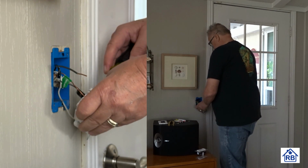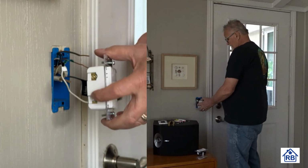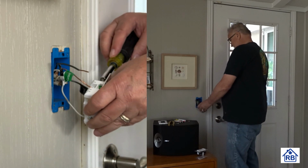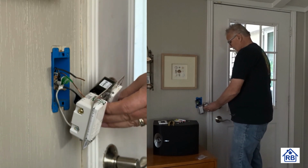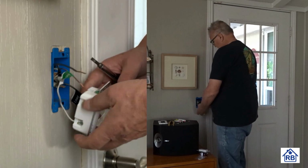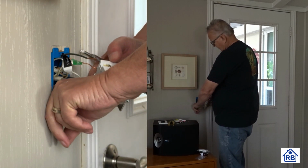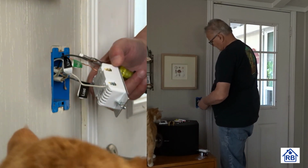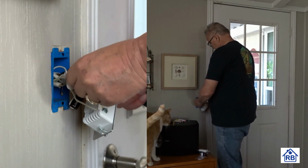Another thing to think about too is will the plug or the switch, a pretty good size, fit in the box? I would say that it's similar in size to the one that we had in there before, and that fit. So we shouldn't have an issue with it, but sometimes you may have a shallow box that isn't very deep. This one's probably, well, it's my whole finger, so what is that, 3 inches, maybe 2.5 deep. So it's pretty deep.